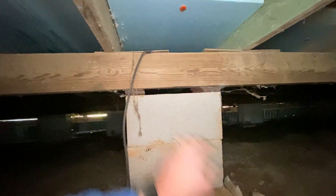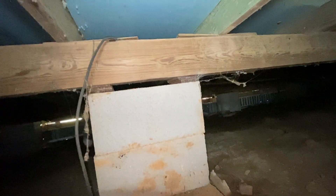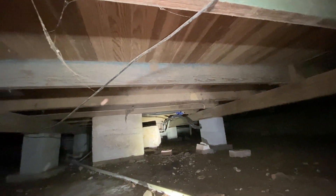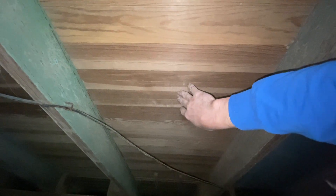Some of them are loose. This one is sturdy, shimmed up with steel shims on both sides — we'll swap that out and get that shimmed the right way. But even if we reshim this home all we can and get the proper number of base block combos in here, I think your floors are still going to be loose because of the spacing on the floor joists and the fact that you have no subfloor.